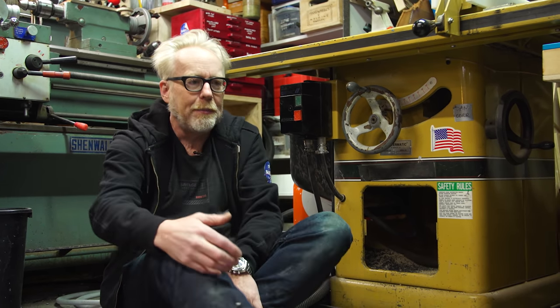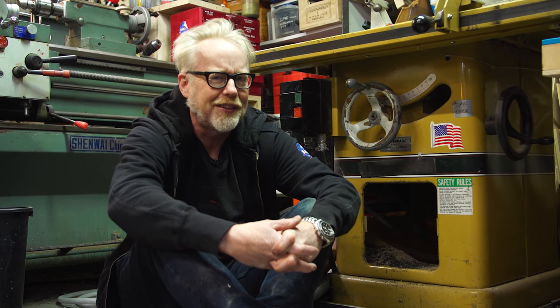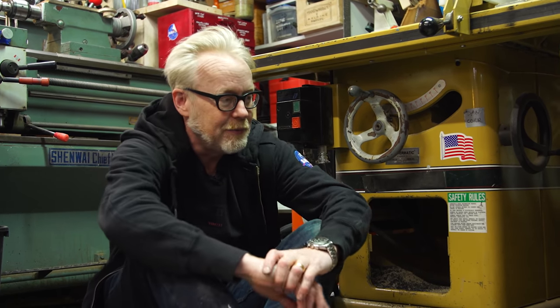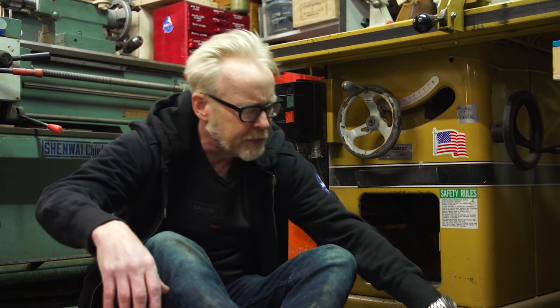So I called up my friend Kip, and he knows this kind of stuff. I was like, dude, does a ribbed hose actually inhibit the dust collection tube from being able to move the air? And he said, yeah, actually they do. The ribs cause a little bit of turbulence that basically effectively makes the tubing smaller, right? It doesn't have the same amount of suck.